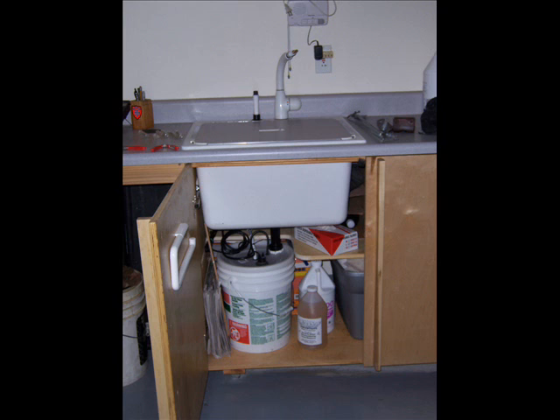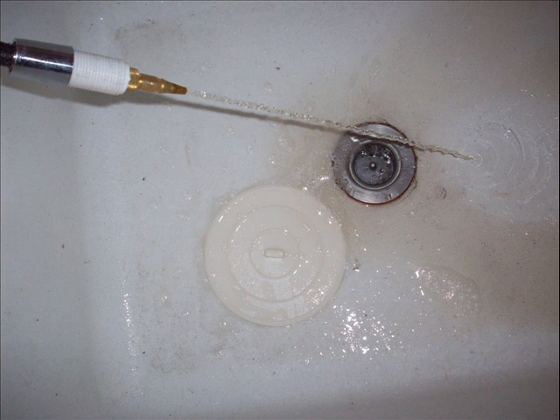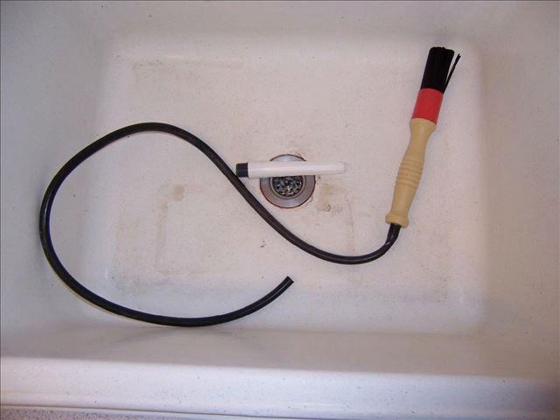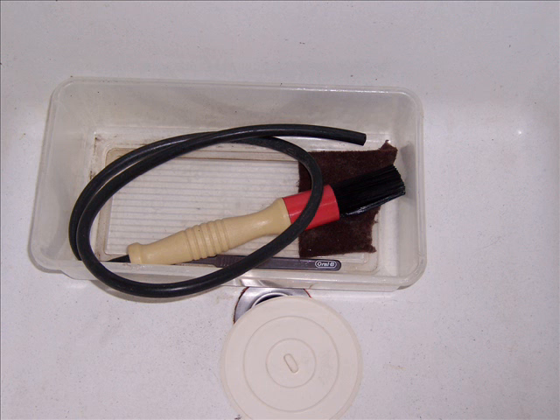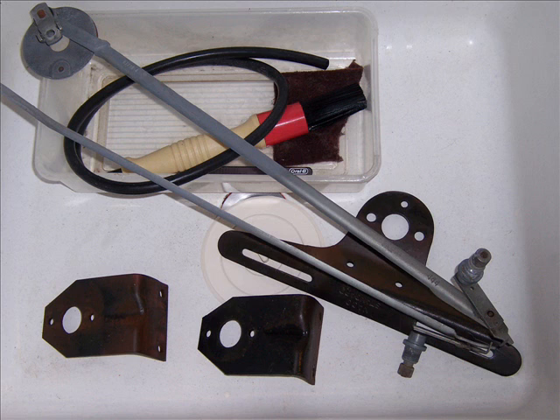There's the complete system set up underneath the sink with my excess solution in a half-gallon jug sitting next to the reservoir bucket. Fire up the pump and you get about a half gallon per minute with the brush restriction, or a full gallon per minute with no restriction — meaning the bucket is cycled once every minute. The sink is deep enough not to splash water and crud on the walls or floor. I also picked up a shoebox-size plastic bin at Home Depot to put parts in for washing with a Brillo pad. Here are some parts I cleaned in the thing — it works just fabulous. Now I have a parts washer I don't need to worry about: I can clean the parts, I can let them soak.